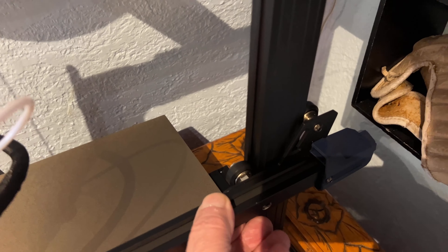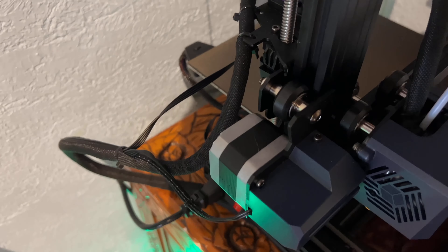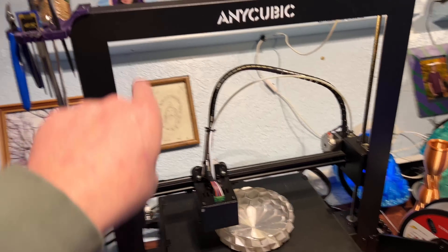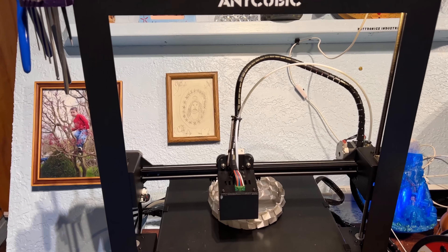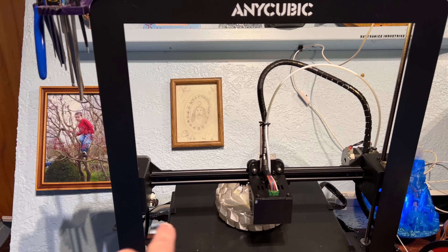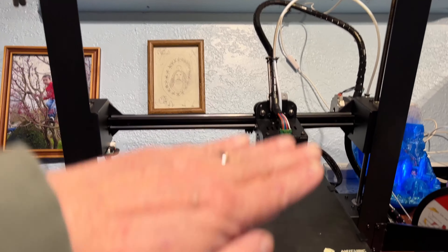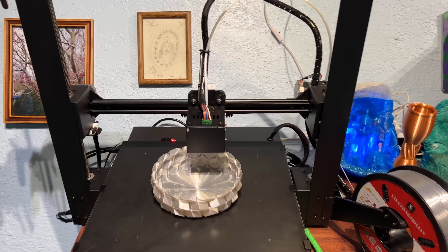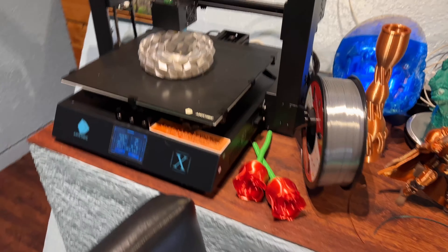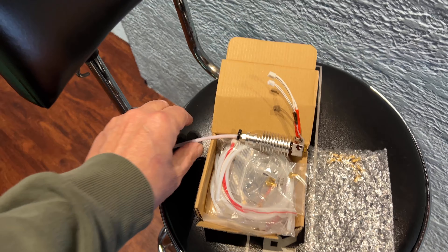This end is totally loose and just on rollers, with only one motor. I prefer the solid gantry — that's never going to get out of alignment once it's set up — and the dual motors that move up and down, which is called the Z-axis.